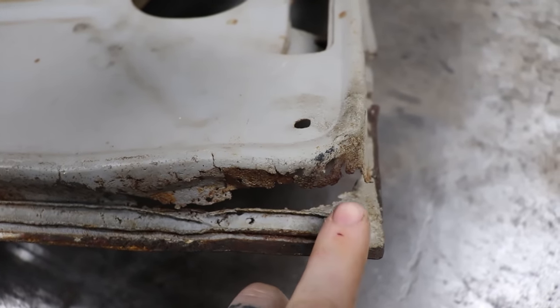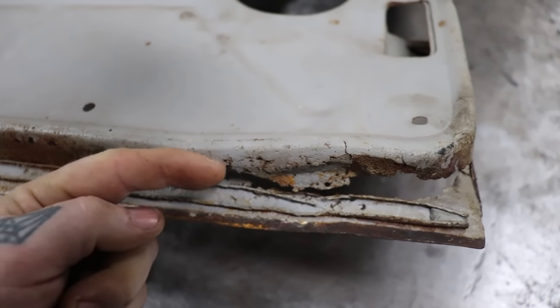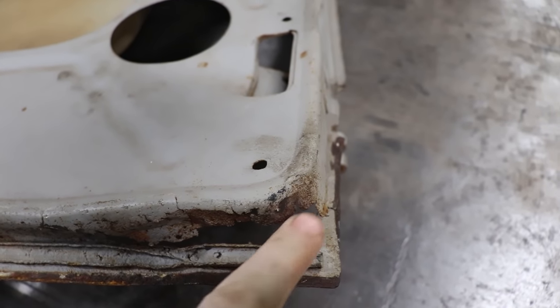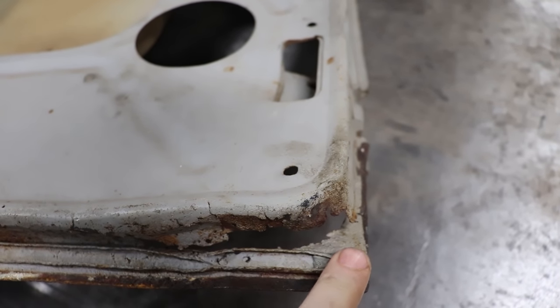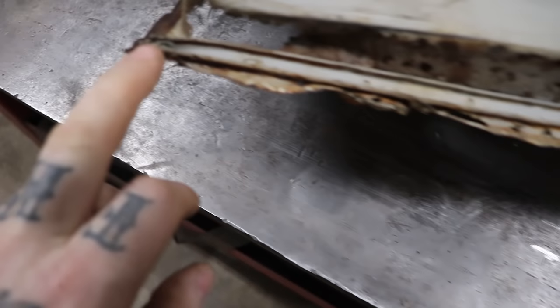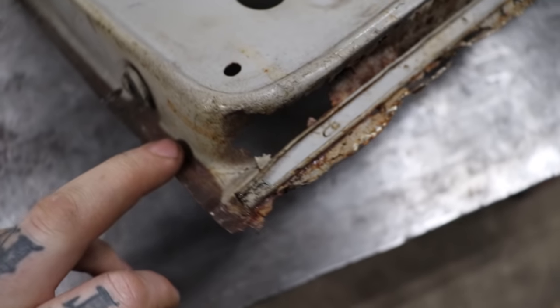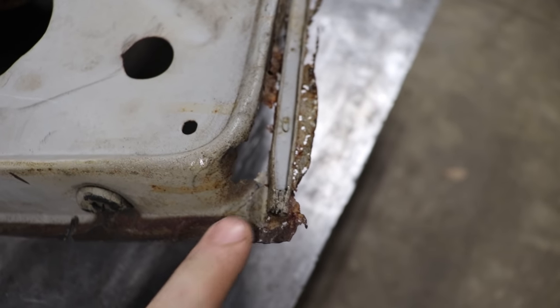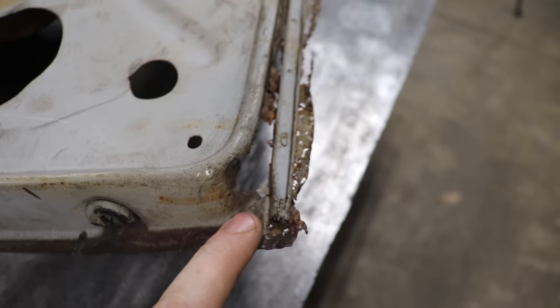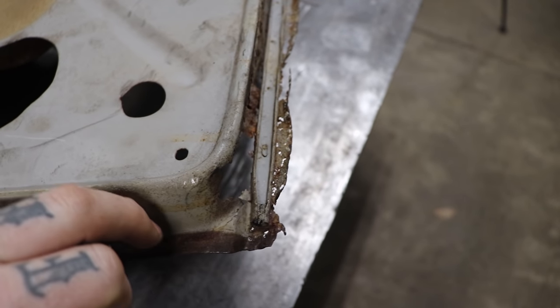But we need to make a piece that goes straight up and down and then break it 90, but leave enough width in here that we can leave that corner. Now I may need to do something a little different with that. I'm not sure yet, but I need to leave enough that it goes down to do that corner. So I'm hoping I can just use a shrinker stretcher and work these corners to get it to wrap around on both sides, and then it's just a flat flap.